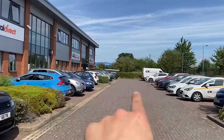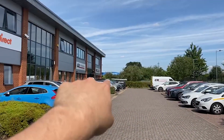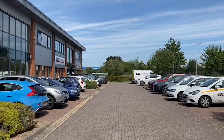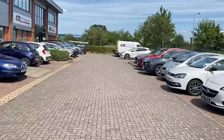This is where the EV chargers are going. There are EV chargers across there, a duct in this corner, and there's going to be an EV charger just here. We'll duct under with a big cable to a cabin in the corner — groundworks guys are doing that now — and then there'll be four charging points over here coming from that duct, with a little three-phase fuse board to supply them all.